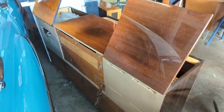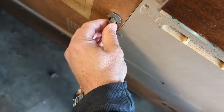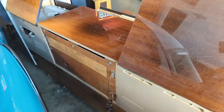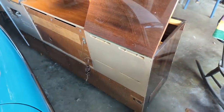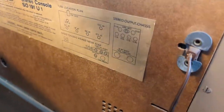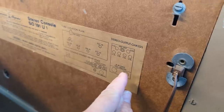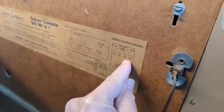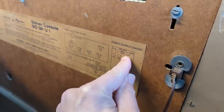I'm not going to plug it in because the cord is frayed, probably from being shoved up against the wall — not uncommon. I'm going to take the back off and hook up a cheater cord. I want to see what's going on inside. I've worked on large Grundigs like this before and they tend to have several different chassis. Here we have the rectifier and output chassis which has a quad of EL84s, which probably means push-pull audio.